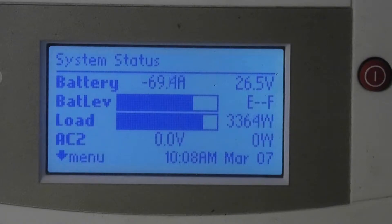Interestingly, since the battery voltage doesn't drop as much as it theoretically should, it starts declaring the battery fuller than it is. As you can see, the battery voltage has dropped from 28-something to 26-something. When it hits 26, it'll start a timer — if it stays there for two minutes, it'll just shut the car back off because we don't want to run our house batteries down.